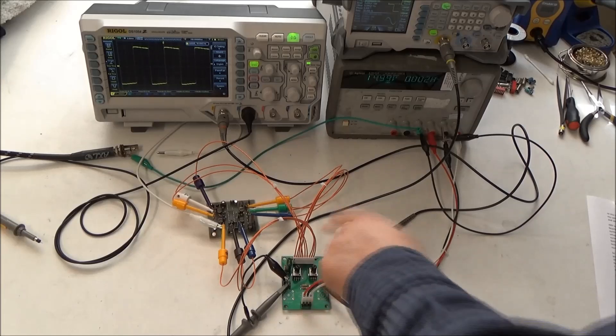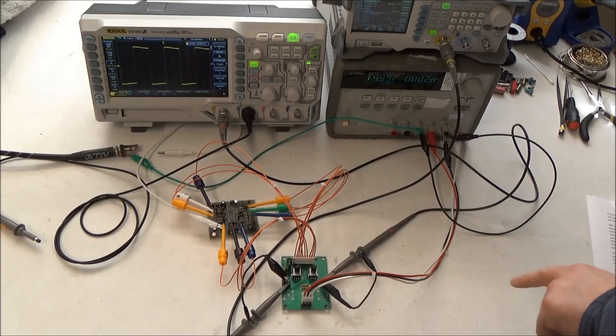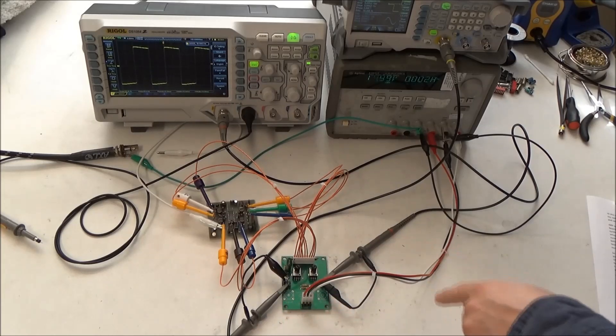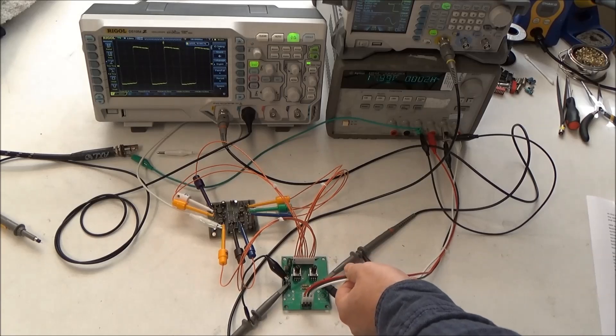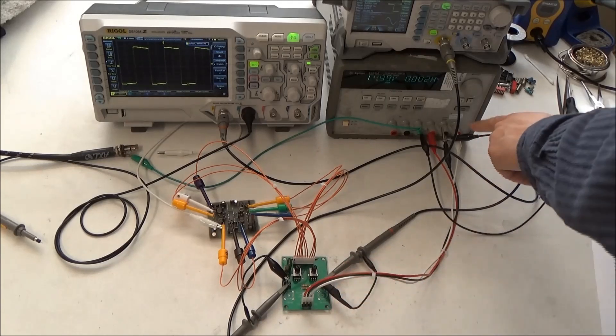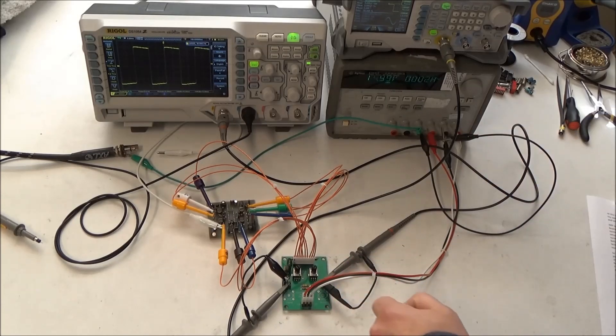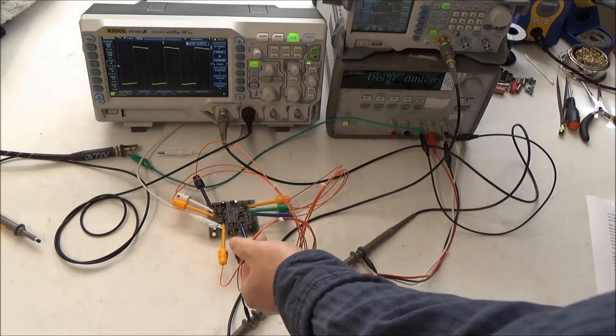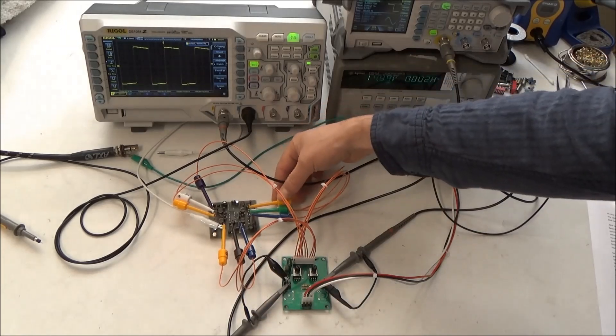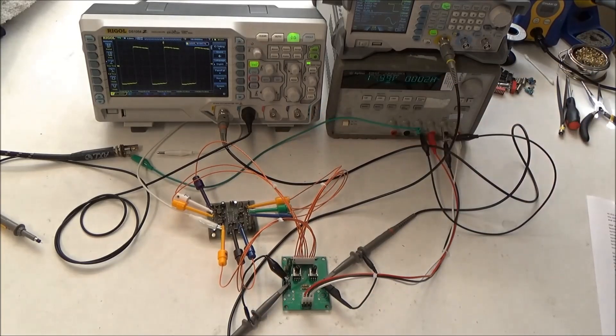Next, I have a little circuit board which I made that interfaces all this test equipment to the filter. There are a couple places for some BNC jacks so I can just connect the scope and the function generator with coax cables when I get the right size BNC jacks. I made a little wiring harness here to connect the board to the power supply, and then I made two different wire harnesses to connect the board to the filters. This one that I've got installed here uses these little mini grabbers to grab onto the long pins of the original ARP modules.